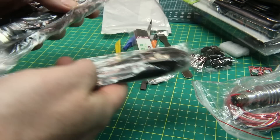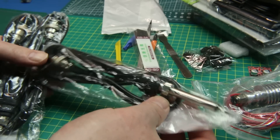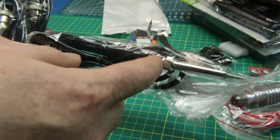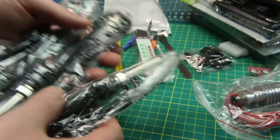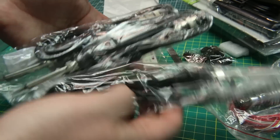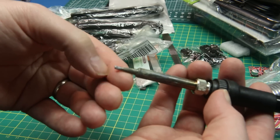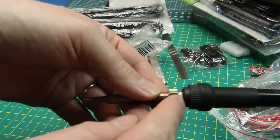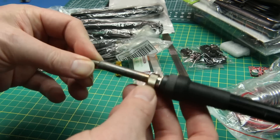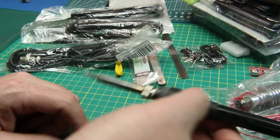Speaking of my cheap solder station — I very seldom go through an iron anymore. I used to burn them up because I run the WEP wide open all the time. These cheap irons will degrade — they're like two or three dollars a piece — but when you buy a bunch you have enough to last many years. The one I'm using is several years old, a little oxidized and rough on the tip, but not melted out. I run it full tilt boogie all the time. People who set their temperature down low — just aggravating. Run it wide open, and the worst case is you melt out cheap tips, but your soldering will be 10 times better.